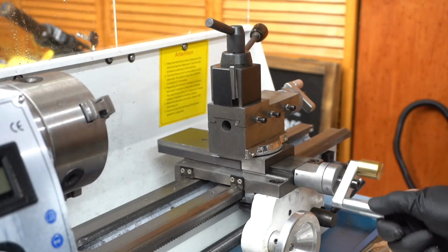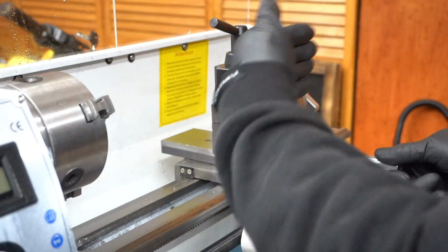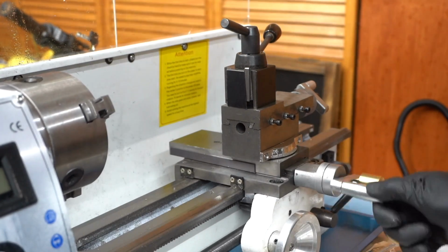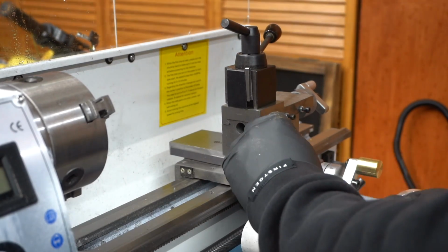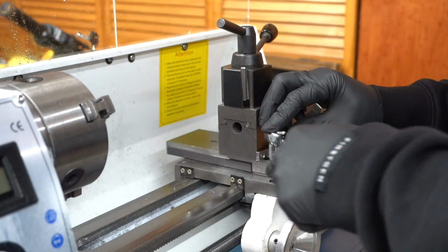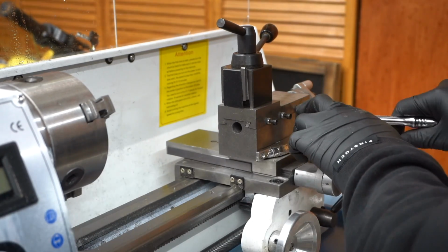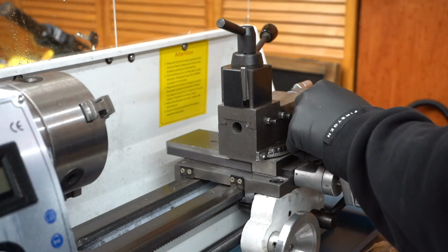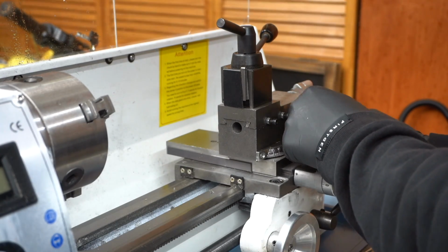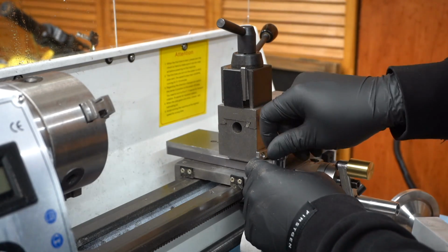So we'll see. But I think if I take this bolt off on this side for the backstop, I might be able to just bend it enough to slide this completely off the rail to the right. So we'll start by, actually this needs to go forward, and then I'll start by loosening these two bolts, and this basically holds the saddle onto the feed screw. So once I get that off, I should be able to just slide the saddle back and forth along the rail on its own. So I mean, if this backstop wasn't in the way, taking the saddle off would have been super quick.